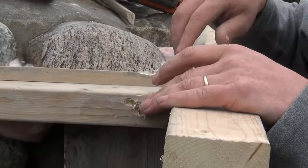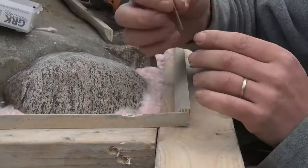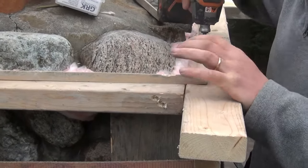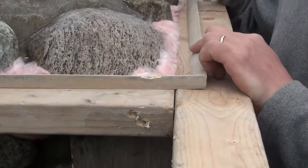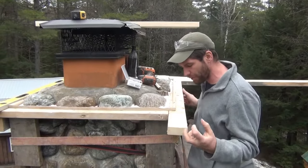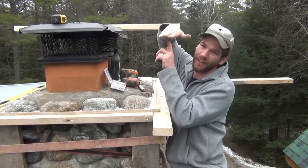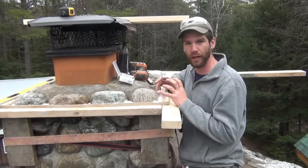So what we do is take three-quarter-inch quarter-round, 45 it at the corners, and place this first right after we've packed the fiberglass. We've been finding good luck with these GRK thin-shank wide-head cabinet screws. I mention cabinet screws rather than finish nails because if you use a finish nail, you can have a disaster — when you pop the form out, the finish nail head pops through and those pieces get stuck on the underside of your concrete. When they get wet, the wood expands and you'll be forever trying to pull them out.